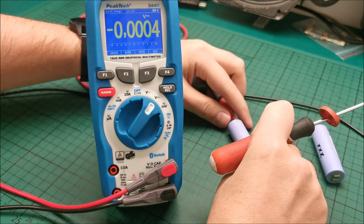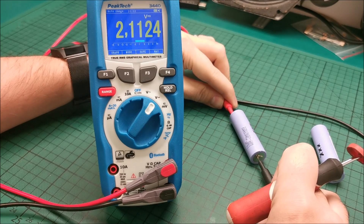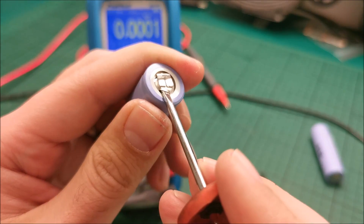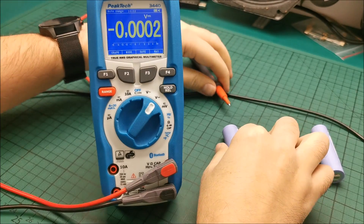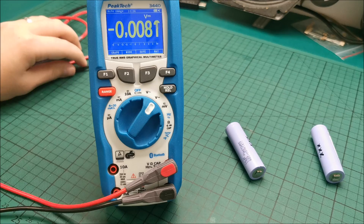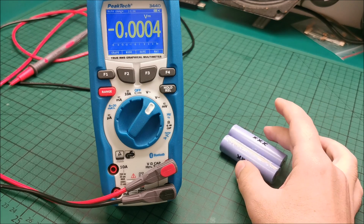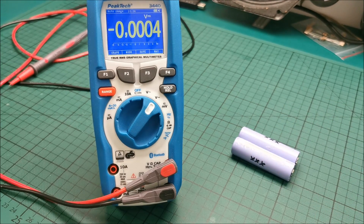Let's do it on another one so you don't say it was just a random lucky thing. Same situation — something that manages to go through that insulator weirdly. Again, lift this a bit just so I have more room to go deeper in there and press on it. And now in theory again we should be operational. This one has a lower voltage but it's working and it's stable. But not safe — stable does not mean safe in this situation, because we messed with it. It was basically triggered, so these cells had a reason to disengage. They were overloaded, overheated, overcharged — I have no clue what happened to them.